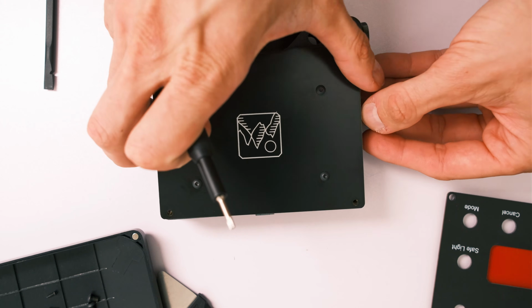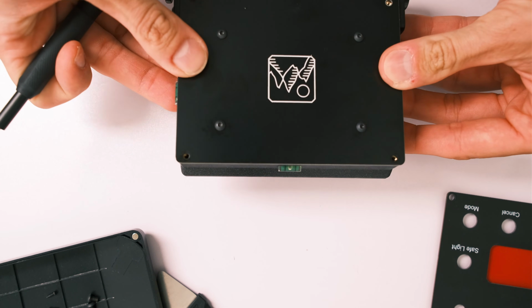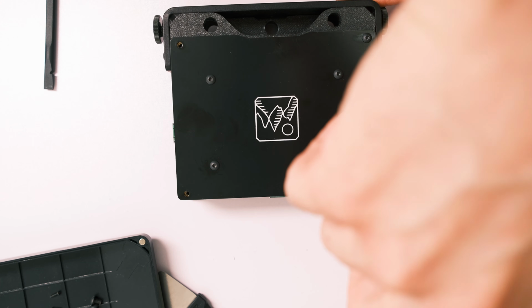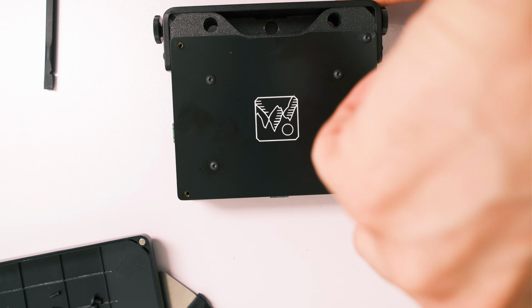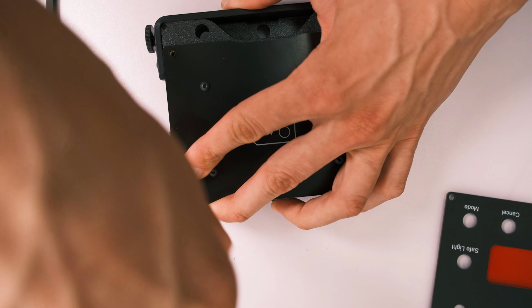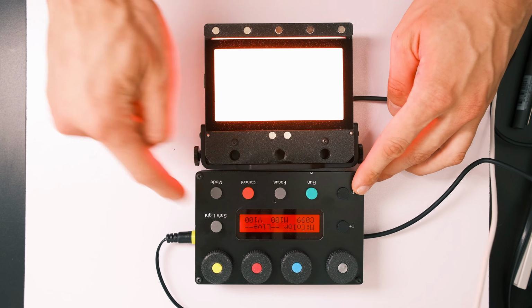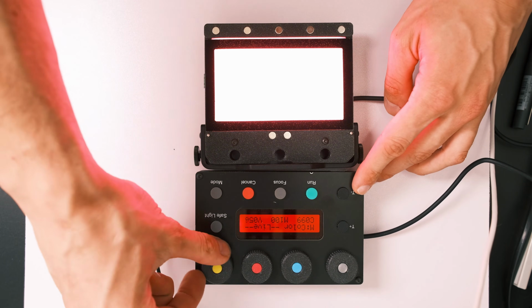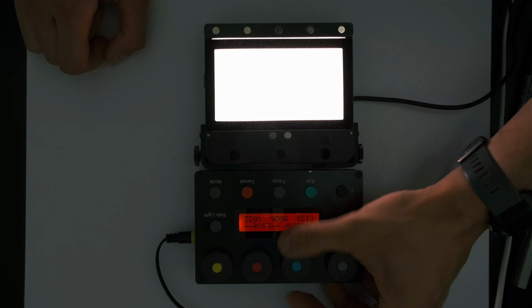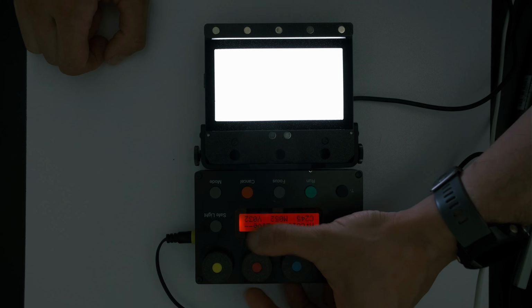So now I find out that the whole enlarger is controlled by an Arduino Nano, 5 volts and addressable LEDs with 4 channels, white and RGB, without any current control as far as I understand. And also, as I understand, this is not really a precise way to control the LEDs to keep them stable in terms of color, but as you saw, it works perfectly fine.